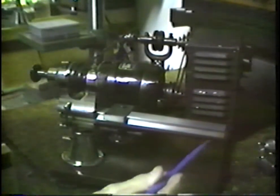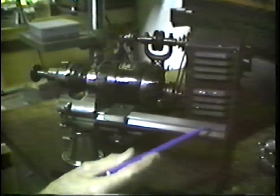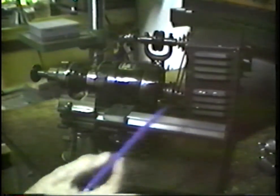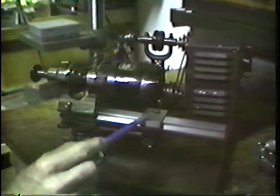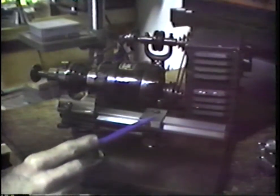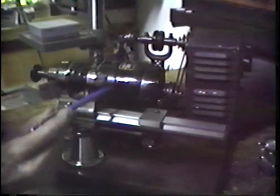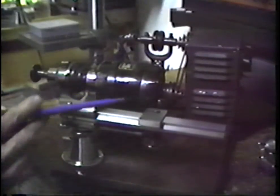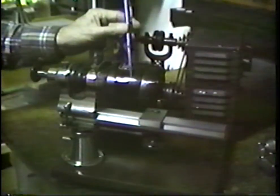The bed is a classic watchmaker's bed length. If we look, we see that it is a V-bed lathe, unlike most American watchmakers' lathes. It has a draw bolt and a shoe in the center of the bed. The fixtures used in this lathe do not interchange with American lathes, except in the headstock. It is 50 millimeters high in the headstock. It has the Webster Whitcomb size spindle.